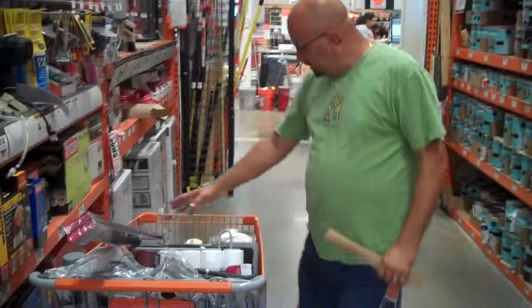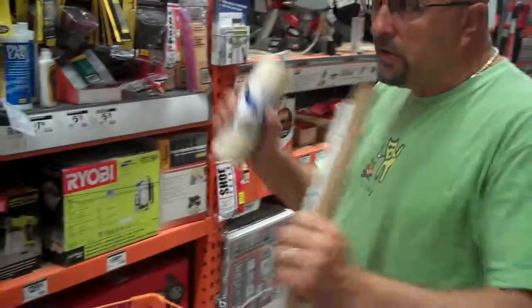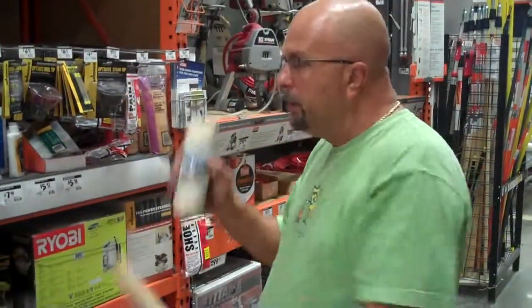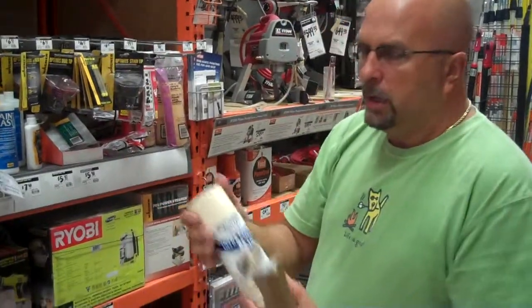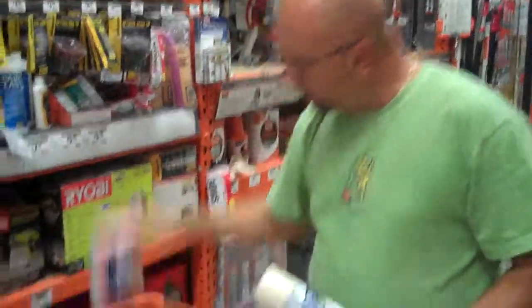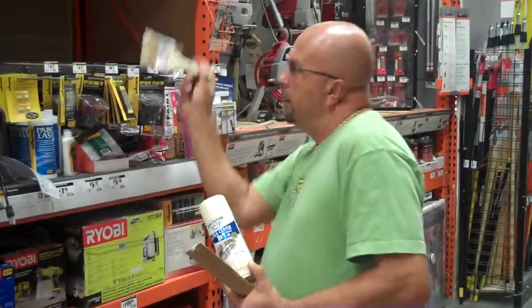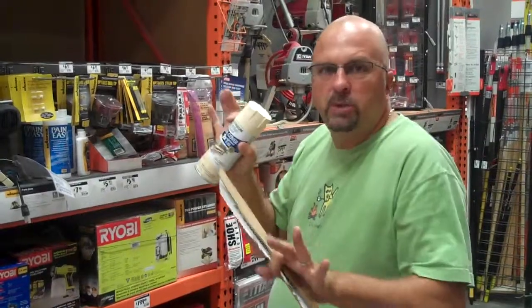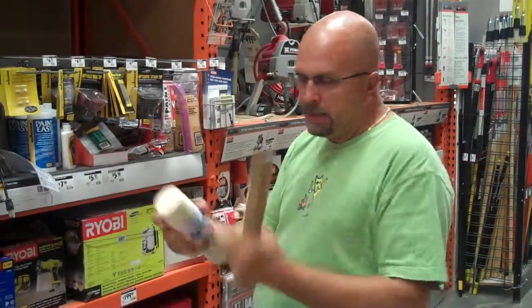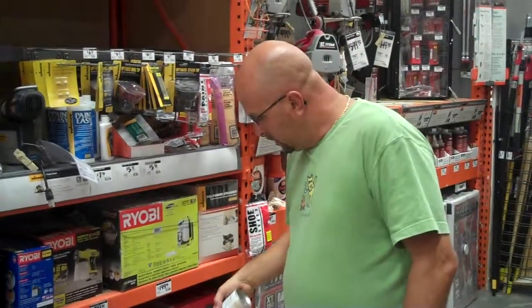If you look at all the things that we have, we have the sprays. When we're finished painting the fire escape, the guy who's the final painter is not only brushing and painting it, but on awkward situations he's going to be spraying, because we're going to roll the paint job with rollers, stab the paint job and paint it by hand. The final step is for awkward situations where you need nothing but spray — here's the matching colored gloss already in here.